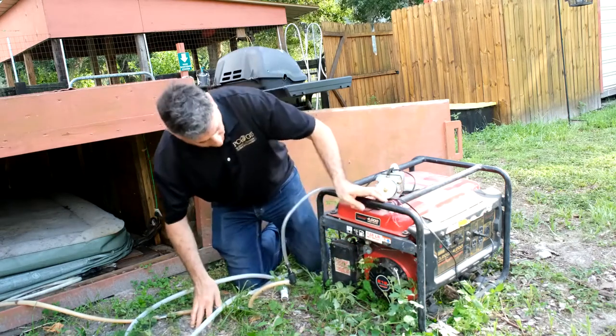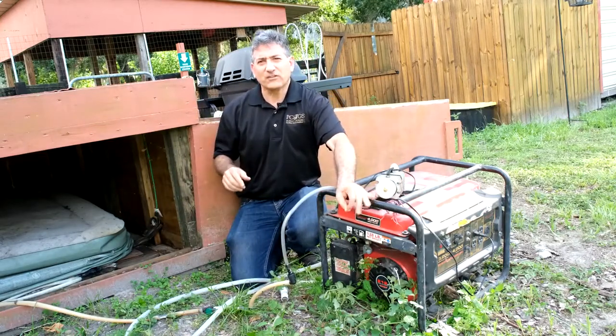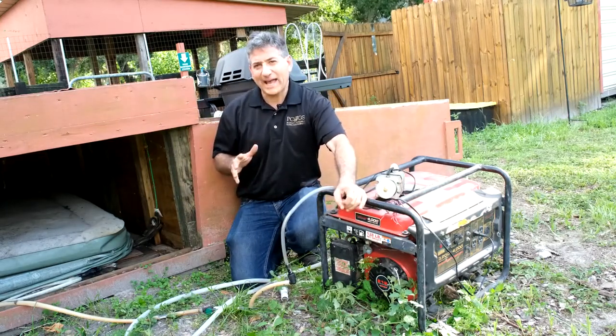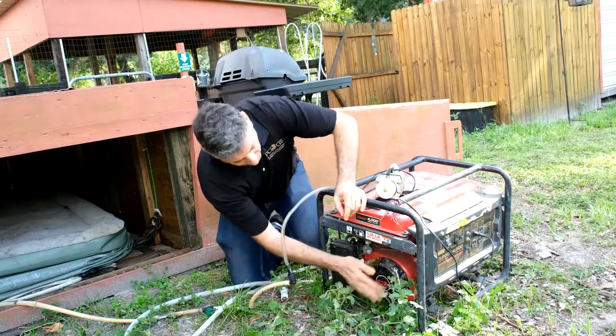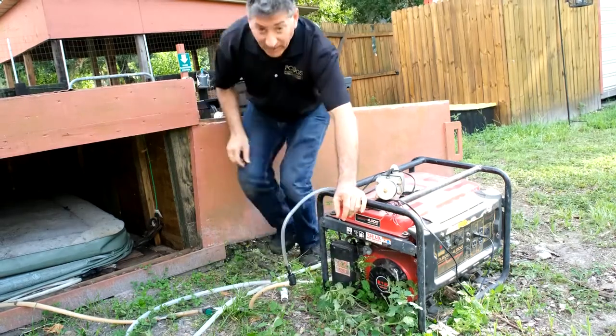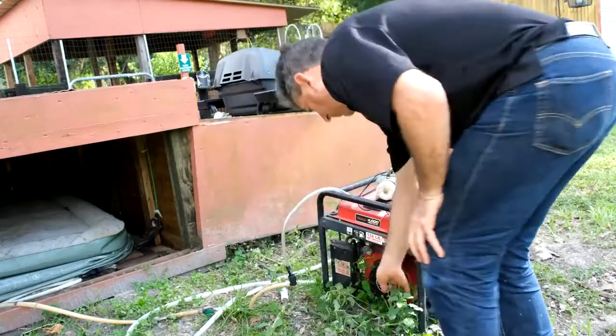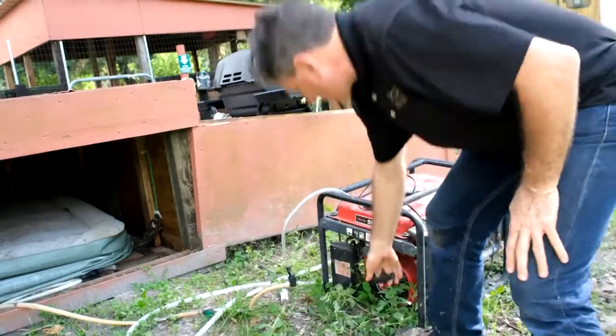And then I'm going to pull the cord. Another reason why it's good to start the engine on gasoline is because biogas is fairly wet gas, and it's not good with spark plugs — you'll end up breaking your cord more often than not pulling so many times for a pull start. So start it on gasoline, a small sacrifice. Start it on any liquid fuel that you can.